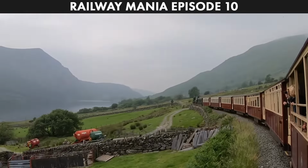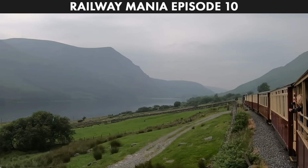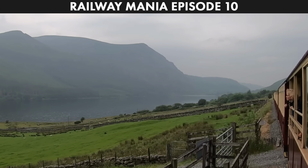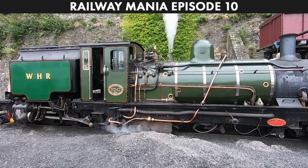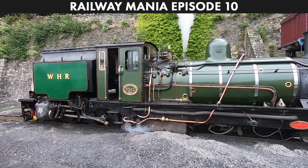I know 138 is currently running with Vesconite on the bottom of the pivot where it sort of wears, just to see what happens. And so it's almost like a replacement bearing surface. Yes, that's the best way of describing it. And that really is a modern solution, because that stuff didn't exist when the locomotives were built. No. And what I find quite a coincidence is that this stuff was developed in South Africa.